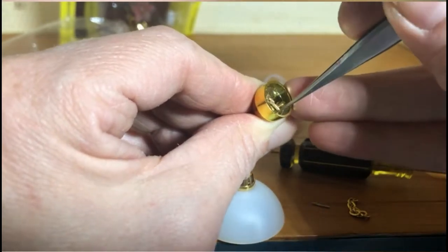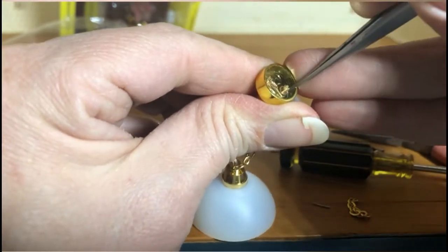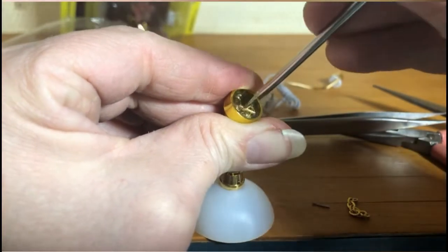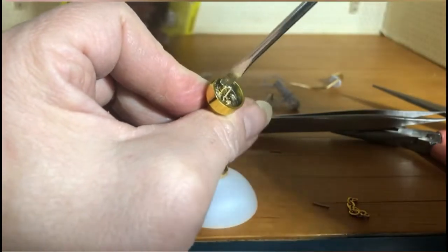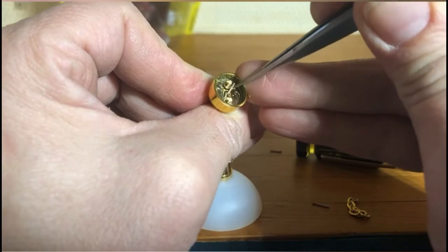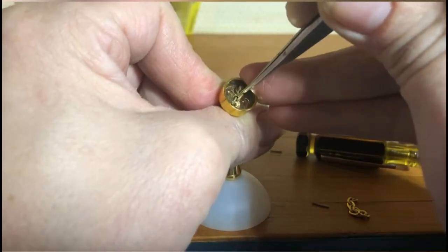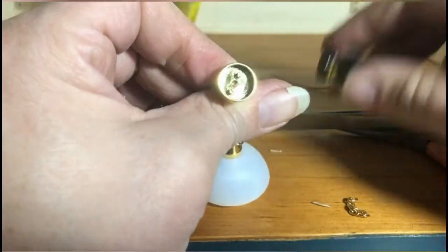You can see my frayed wire sticking out because I didn't twist it quite enough. I'm using the tweezers to tuck it under there and pull it around so when you can't see it you know you have it in the right spot. There's a little bit of wire showing so I'll lift this and push it back under there just a little bit more — I like to exercise caution, I don't like to have to do these twice. Now we don't see any exposed wire.